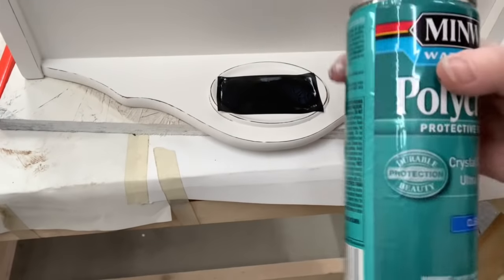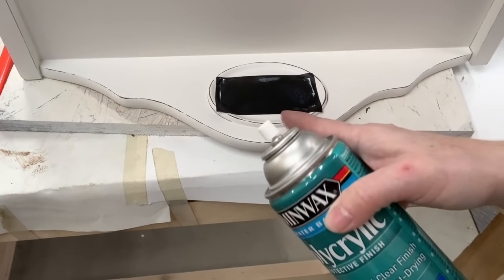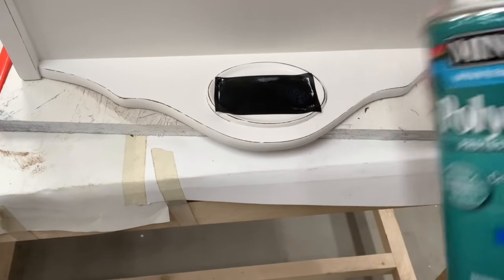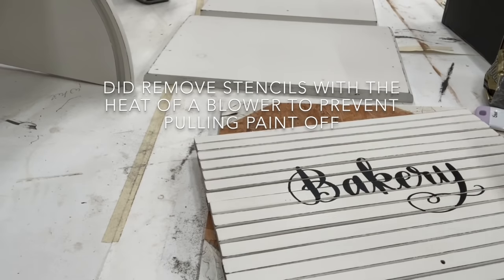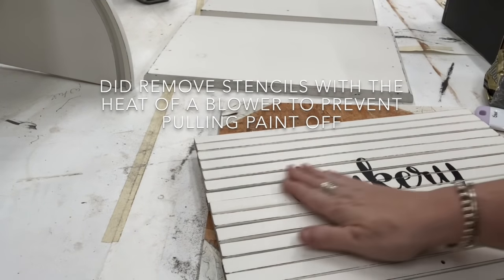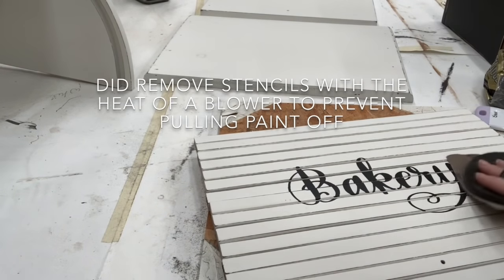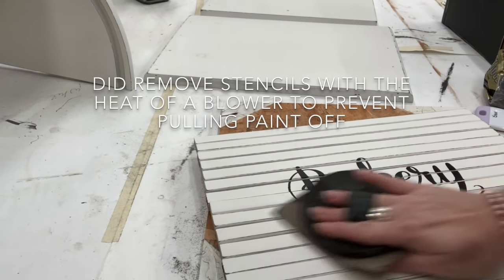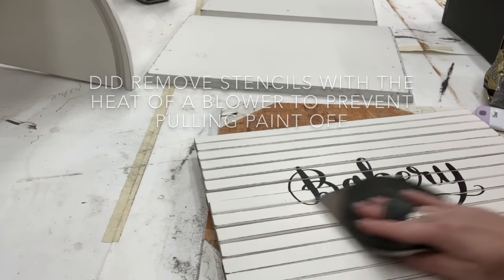For this little ceramic piece, I had already planned on this when I started the whole process of spraying with polycrylic, because I'm not really sure how it's going to stay on ceramic and I want it to stay on really well. For this roll top, because of the water damage, I'm really protecting these bread boxes. The polycrylic goes a long way — just sealing that bakery design I had just put on there is well worth it. Then I just take that 320 sandpaper and lightly smooth them. On the ceramic piece, I left it alone and did not touch it because it needs some cure time.